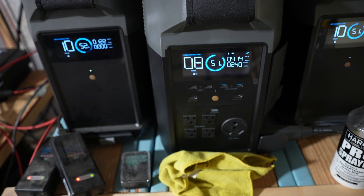In the previous video I showed how you can charge your Delta Pro with an external battery bank by directly connecting the battery to the Delta Pro. The Delta Pro will charge from that battery bank at approximately 420 watts. The reason it only draws 420 watts is a safety feature — it treats that source as if it was a car battery or car charger, so it only draws 8 amps instead of the full 15 to 16 that it can draw. You would think that a 48-volt battery system at 16 amps should get you 720 to 800 watts, but the Delta Pro doesn't do that. It limits it to 8 amps, giving you about a 400-watt draw. So directly connecting your battery to your Delta Pro is only going to give you about a 420-watt transfer rate.